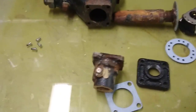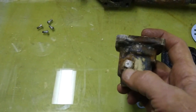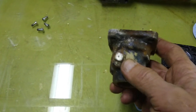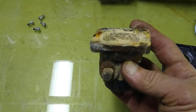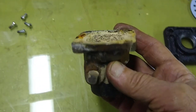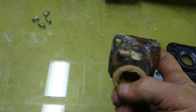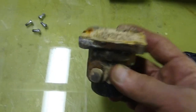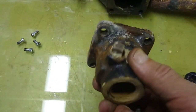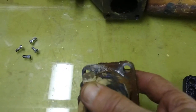One comment I'll make is that this is the part where originally the blow-down valve was installed where that plug is. After several years that stopped working. About 25 or 30 years ago, I went to my plumbing supply house and the knowledgeable guy I had bought the boiler from said to take out what was originally the valve, use the female threads, and put a ball valve on the bottom of it — which is what I did. That's been lasting probably for the last 30 years. But when I took this off and cut the heads of the bolts off, I messed up the flange a little bit, so I needed to get new bolts — regular hex head cap screws.